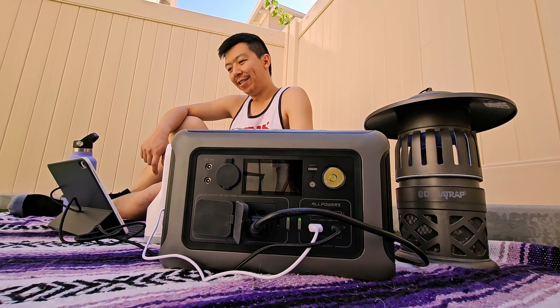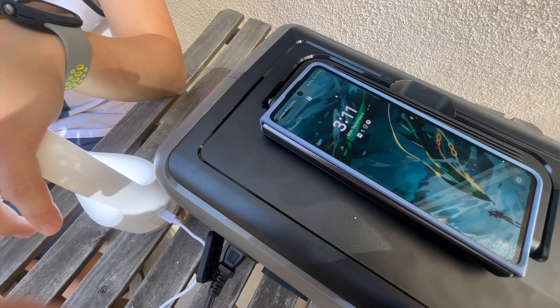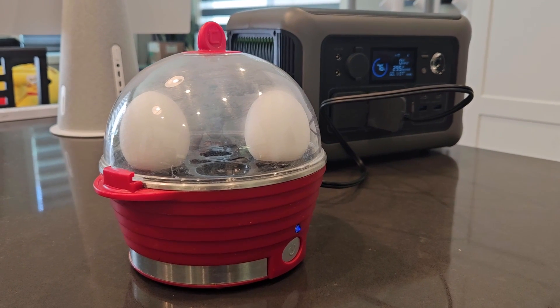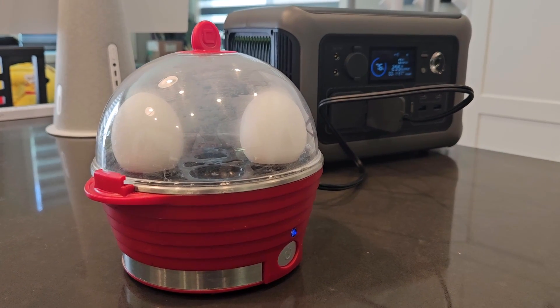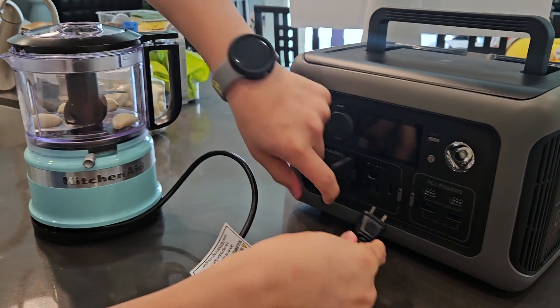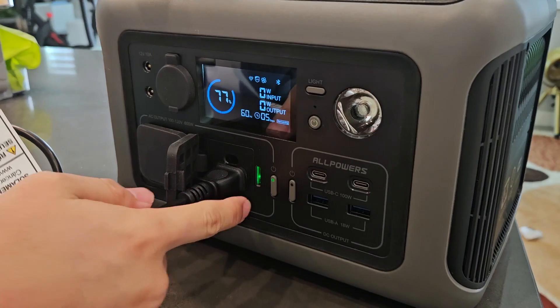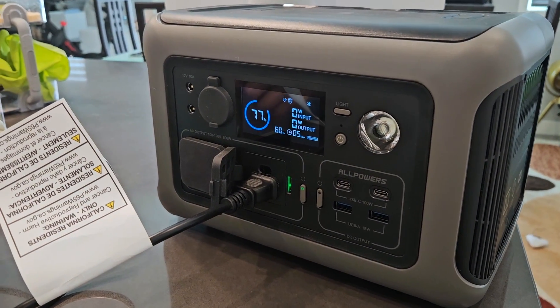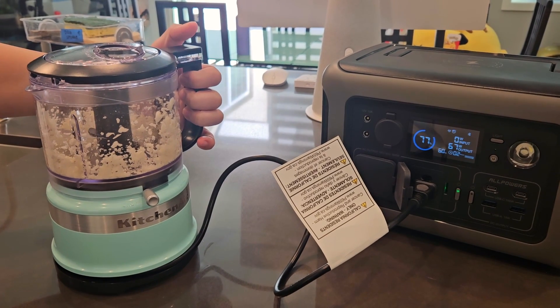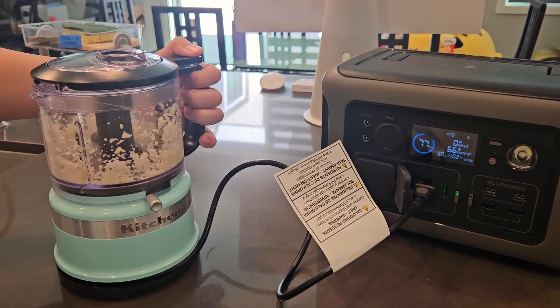It also charges personal devices relatively quickly. The Qi wireless charger charges at 15 watts with compatible devices — actually pretty comparable with physical Qi chargers on the market right now. As a 600-watt AC inverter, laptops and computers aren't the only things this portable power station can keep going. A combined 600 watts is enough to power some low-wattage home appliances for a camping trip — you can plug in a blender, a coffee machine, and other cooking peripherals. You could even plausibly charge an e-bike if it's under 400-watt input. The AC input max is capped at 400 watts, solar is capped at 300 watts, and the car port is 200-watt max input.